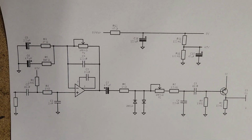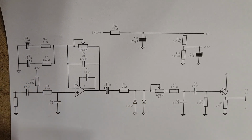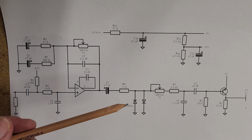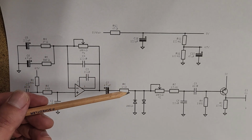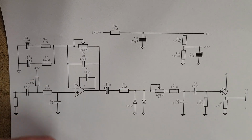The big difference that we can see, of course, is there are no diodes in that feedback loop. Instead, once it's amplified, it comes out at a higher voltage than when it went in, and then we have these 2 diodes going to ground instead. And what that's going to do is create that hard clipping. More clipping, more of everything, the parts of the sound are getting sent out of the signal and down to ground, and that's what's creating that hard clipping.